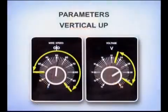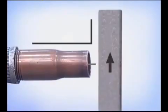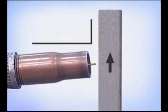For the vertical weld position, E71T1 is run uphill only. Set the voltage and wire speed in the lower range of the weld parameters. With the wire feed gun nearly perpendicular to the metal, maybe angled up slightly, try traveling straight up without any gun movement. Maintain a constant wire extension to keep the amount of heat at the weld uniform. Watch the edges and the filler metal deposit, traveling up fast enough to keep the buildup from spilling down.